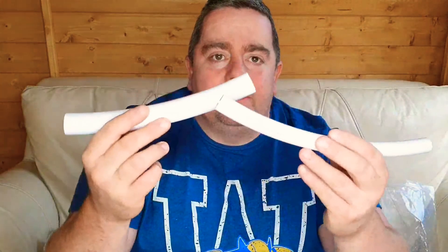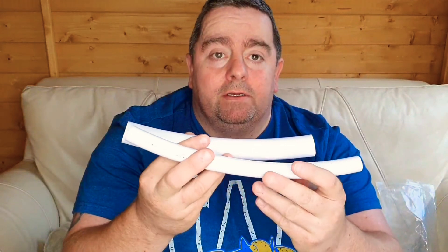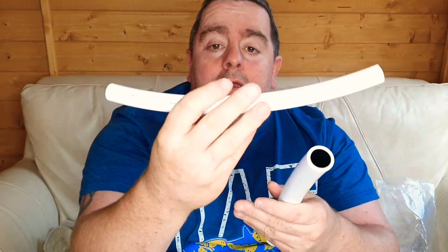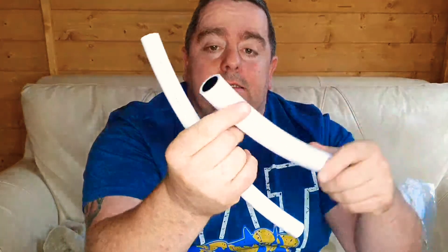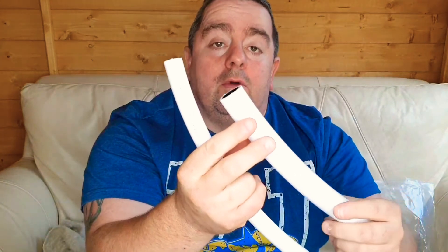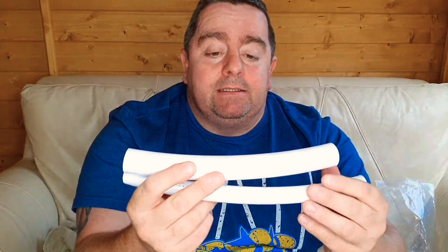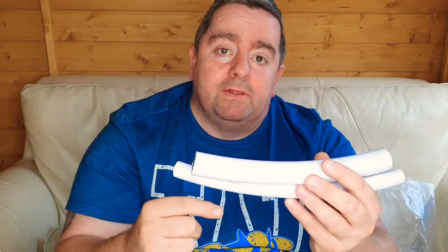The thing to take into consideration when installing any kind of water softener is the hoses that connect the system to the mains. In domestic installs we generally use a 12mm or a 19mm hose. The 12mm goes on a 15mm system and the 19mm will go on a 22mm up to 28mm system. The reason for that is the amount of flow that can travel through these pipes.